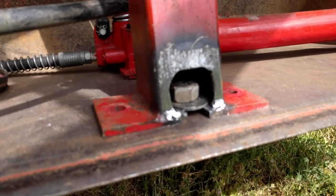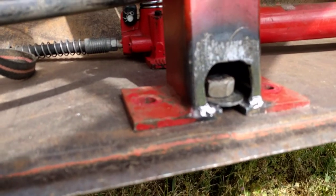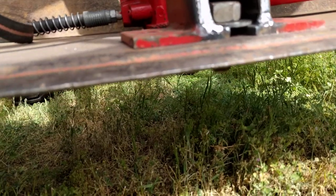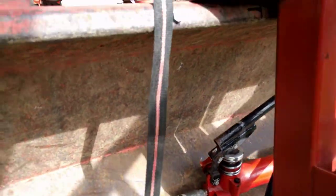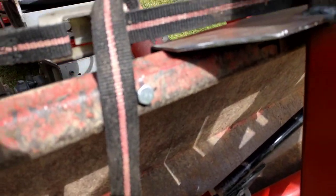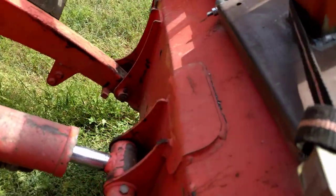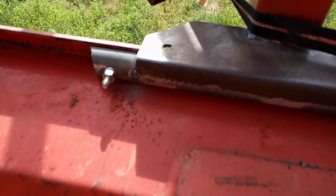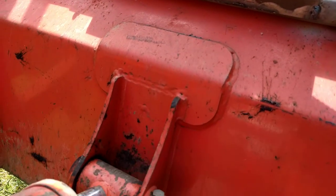What it is — I cut a little notch in there, and I've got a hole that I used to put a ball on for moving stuff around. I just adapted that to the hole and bolted it down. Then I thought, okay, I need a little plate, some kind of an adapter, and put a piece of pipe through there to fit in the groove of the bucket to spread the weight out and take the load down to the hydraulic cylinder.